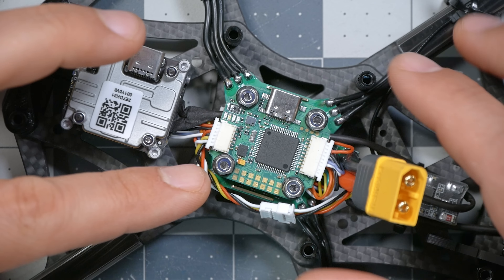The flight controller is the iFlight F722 Mini. It's got an F7 processor, so it can run basically anything Betaflight can do as fast as you want. That's held back slightly by the fact that it has a BMI270 gyro, which only runs at 3.2k — meaning the fastest Betaflight will run is a 3.2k PID loop. Other gyros have supported up to 8k, and many people think bigger equals better, but almost nobody could tell the difference between a gyro running at 3.2k and one at 8k. What really matters is how clean the gyro data is, and the BMI270 data is fine.